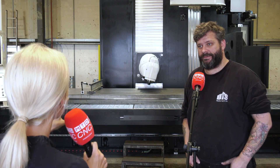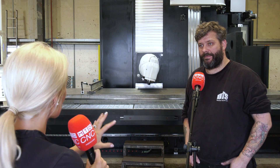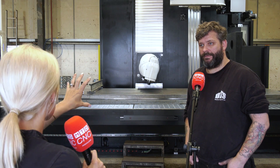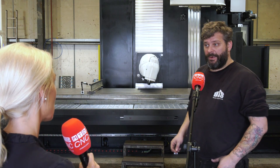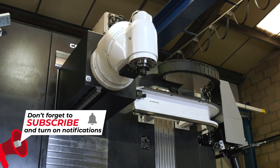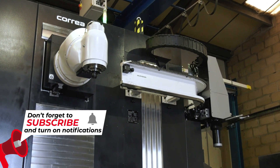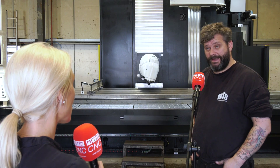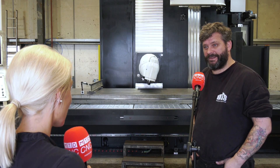What are the benefits of having a fixed table, where the spindle is moving around it? One of the main benefits is you can put high loads on the table and the machine isn't trying to move that load — it's moving around the weight. So it has equal mass all the time, and that's going to help with longevity.